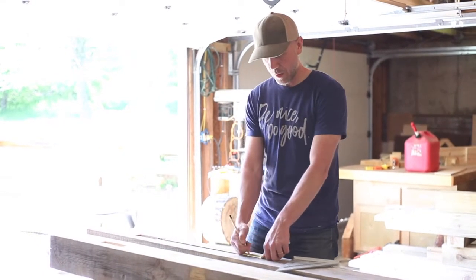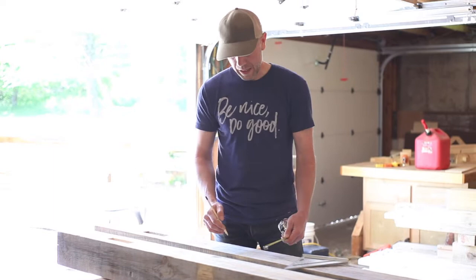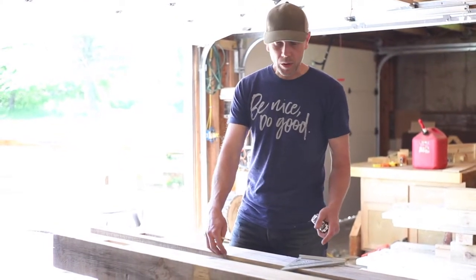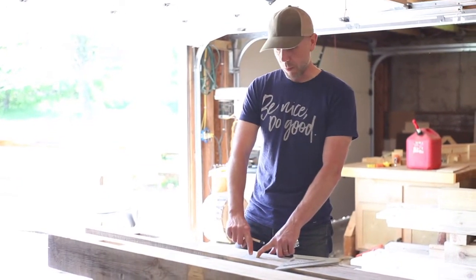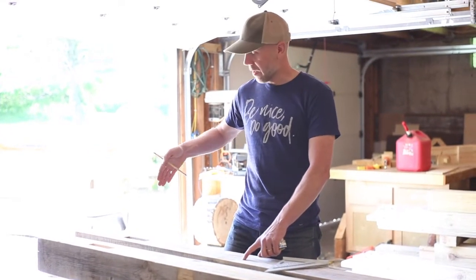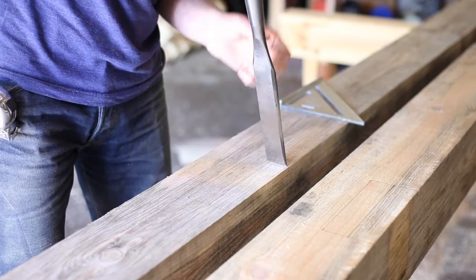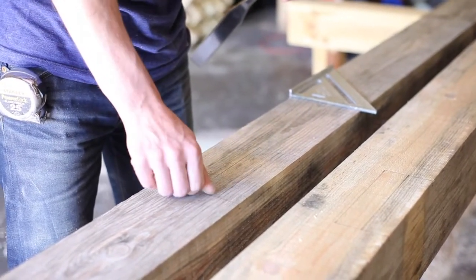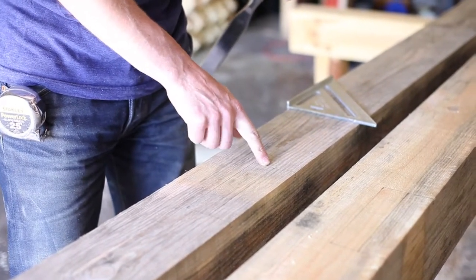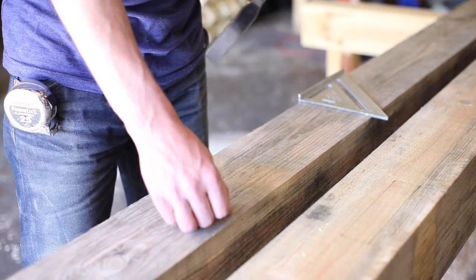We have our mark from the inside of this post to 23 and an eighth inch, and we've laid out three inches inside and then an inch and a half. We're going to do all of the mortises first and then come back and set the depth of the housing. What's really important here is that we don't let this outside 23 and an eighth inch move — that needs to stay right at that spot. If we go too far the post comes in too far; if we don't go far enough the post will be pushed out. I'm not going to set this last line yet because that distance is determined by the width of the corner brace — I'll set the 23 and an eighth and then lay the corner brace in to get a nice 45-degree angle.